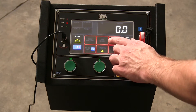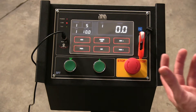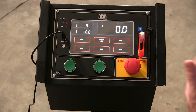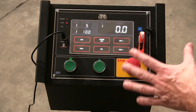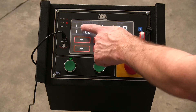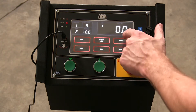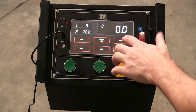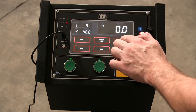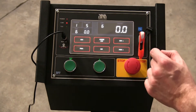Our second option is the self-learning mode. In self-learning you can acquire steps and positions as you roll parts, and you generally start with a blank program. Right now the only thing we have saved is program number one. You can see it has a total of five steps: step one is position 10, step two is position 20, three is 30, 40, 50, and step six is zero.